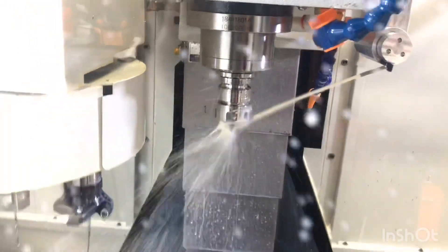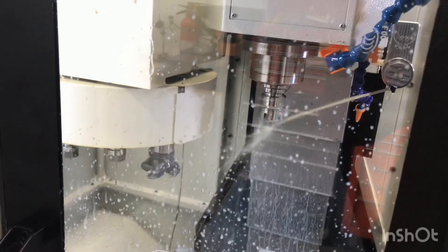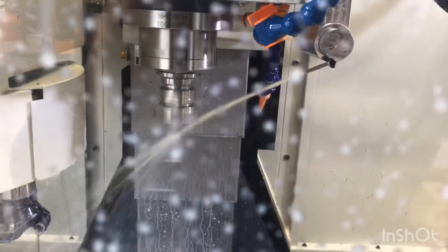If the spindle is running, let's do this — we'll go to 3000 RPM, spindle mode M3. So I think the rotation is what threw me off. I set it static and I didn't realize the effect that a spinning tool would have. Now we can't see anything, but there you have it — everything seems to be working pretty well.